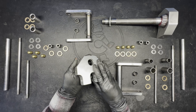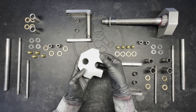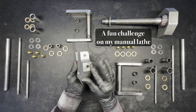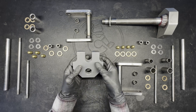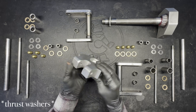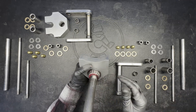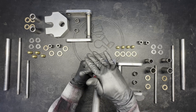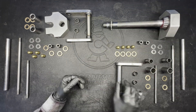This upper yoke was complicated because I had to make the shock mount for it too — that's what's cut out there in the middle. It was also really important that I made the sides of this be exactly four and a half inches across, given the dimensions I'm working with, and perfectly parallel and flat for the bearings and bushings to be able to glide freely along them. Shaping the lower yoke wasn't so bad — pretty much all I had to do was a bunch of cuts with an angle grinder, then sanded it down and hit it with the belt sander to get it nice and smooth.